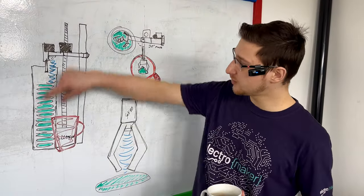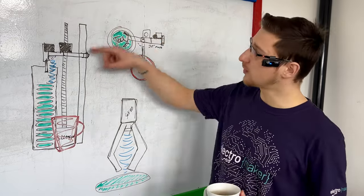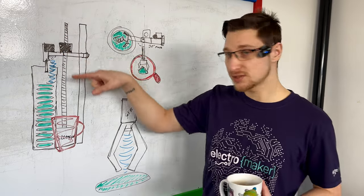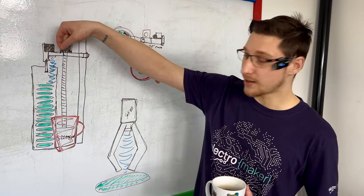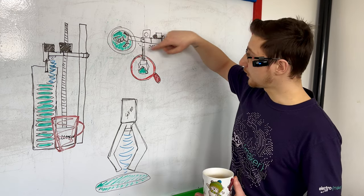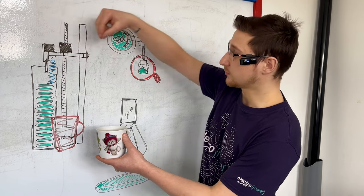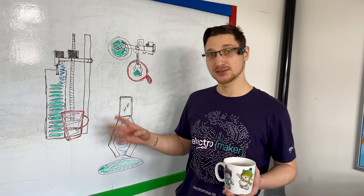Here's the idea I'm working with. I've got a stack of teabags here, and I'm reusing the lead screw system from the 3D printer I took apart on livestream, with some kind of rail to keep it going up straight. At the end of the arm we've got a servo with a pincher claw and a little distance sensor so it can tell where the nearest teabag is. It's going to go down, grab a teabag, and pull it back up. And then up here we've got a secondary servo that swivels the whole arm and drops the teabag into my mug. I put my mug here, it detects that there's a mug there somehow, then it goes down, grabs a bag of tea, swings it over, and drops it into my mug. That's the rough order of operations — I'm going to go and refine this and we'll see what we get.